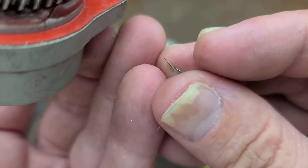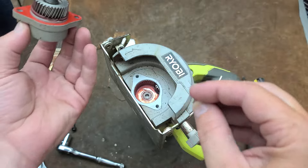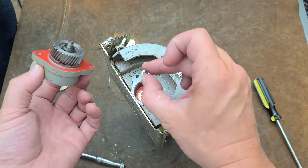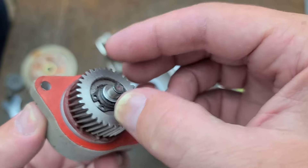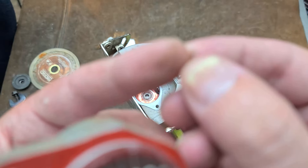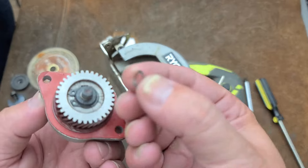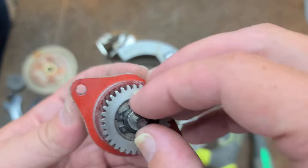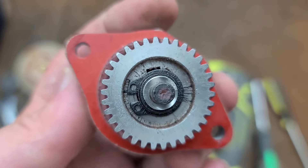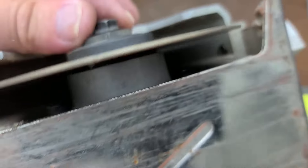One thing to mention about wave washers: we can see there's a bowed-out side — a convex and a concave side. You want this little lobe side pointing towards the ball bearing that's in there. If we have it flipped around the other way, sometimes those raised edges can actually rub on the shield of the bearing. So you always put those towards the quote-unquote fixed object. And this is — I don't know where I got it from, but obviously some kind of overseas-made tool — because that is the exact size washer. They even put a little flat on one side just to give it that extra bit of clearance.